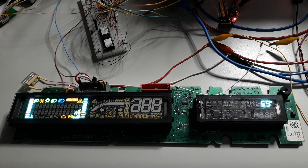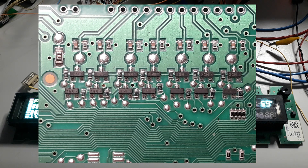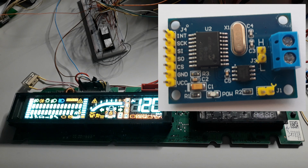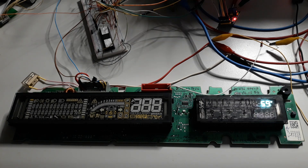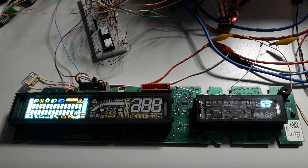The large panel has a set of PNP and NPN transistors for controlling the grids, also recovered to be able to put the panel into operation. The presence of a CAN bus emulator is necessary, which in this case is achieved through a board with the MCP2515 controlled by Arduino. We only have two sockets on the panel: a gray one where the 12 volts DC and the CAN bus arrive, while the red socket is for the radio and is responsible for activating the clock and temperature display.